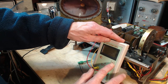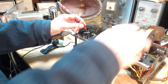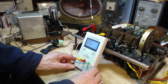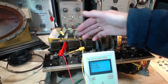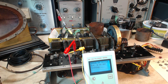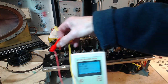Try the other side. Six ohms and 0.25 millihenries. Sounds like a bigger coil. Okay, now, before I forget, which is it's already too late, six ohms, 0.21 millihenry, same coil, a little different resistance, might just be my leads here. And 0.25 sounds like a bigger coil again. So those are really good, these compare really favorably. They suggest to me that the radio is very consistent through there.